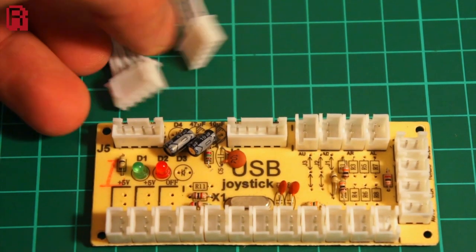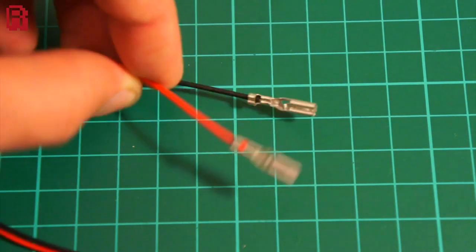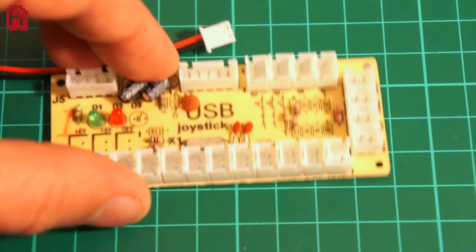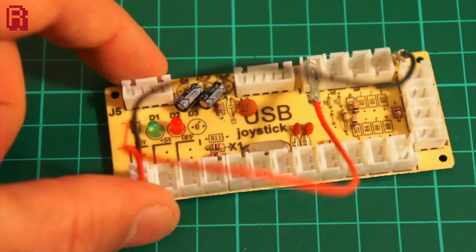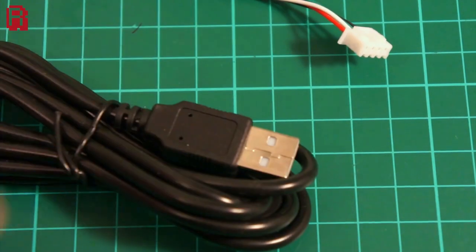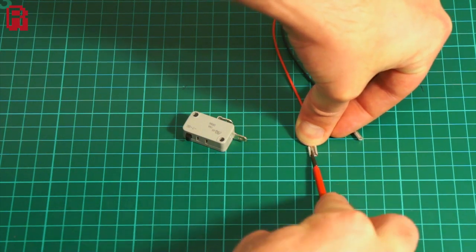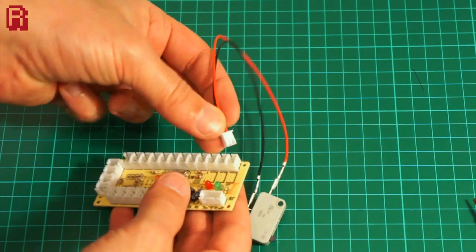If you're using a Sanwa branded joystick you can use the included cable, although it is very short. All other joysticks and buttons will use the included cables, which handily break out a single input into the ground and signal cable to plug straight onto your microswitches. The cables go into the board very firmly, which is great when they're in, but it takes quite a tug to pull them out and I have on occasion pulled the entire plastic connector off the board. I recommend you rest it gently, test it, then push it in fully when you're happy you've got the right port. One small snag I had was that the connectors were too small for my microswitches, but they're easily increased in size with a flat head screwdriver.